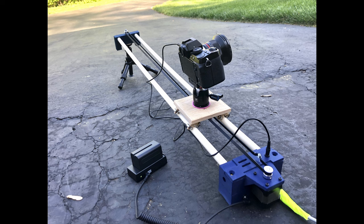My first attempt at building a camera slider used this design with a stationary stepper motor, using a timing belt to pull the camera up and down along some PVC pipes. It technically worked, but it was pretty fragile and a pain to transport. To disassemble and reassemble it, I would need to stretch the timing belt over the pulley. It just wasn't very user-friendly or portable. Plus, it could only move the camera on one axis — the linear axis. There was no pan or tilt.